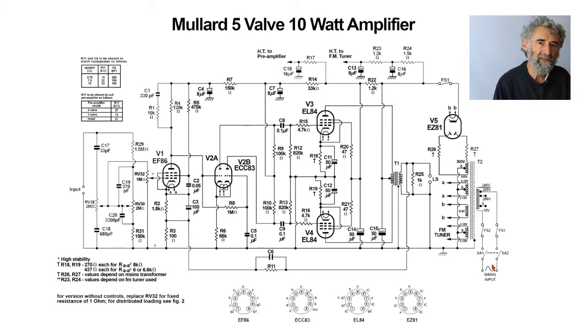The fuse was on the end of the spur and the fuse would have been rated at quite a high current. Nowadays, you could actually dispose of those if you're using a fixed mains lead and use a fuse, preferably of 1 amp, though they're hard to come by. 2 amps, so at the maximum 3 amps in your modern square pin plug.